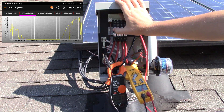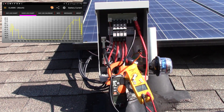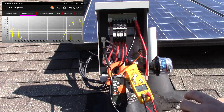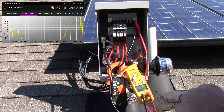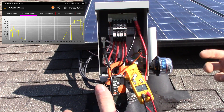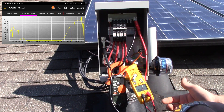I got 0.003 volts across each breaker — the same thing every time. If I had a significant voltage difference across those breakers, that would tell me I've got a breaker problem. So this makes me suspect nothing is wrong up on the roof. The problem would be from here on back, inside the charge controller or the controller itself, which I hope it's not.